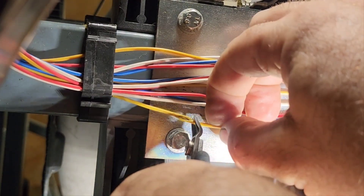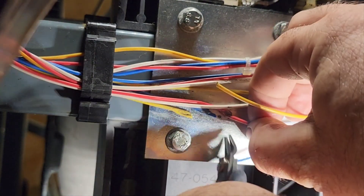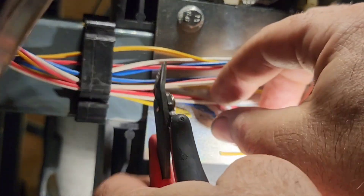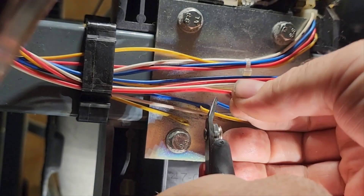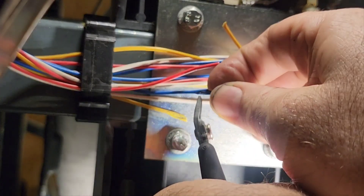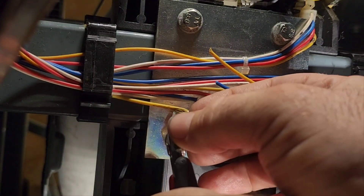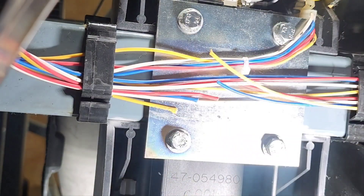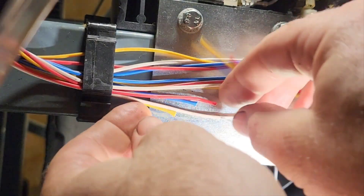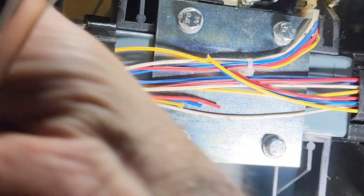What we're going to do is chop at each one of these pinch spots, just off to one side — basically chop out the damaged section. I like to use heat shrink tubing that's filled with a solder ring in the middle. You heat it up, flow some solder between the ends, and it solders it and shrink-wraps it, holding everything nice and tight.